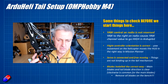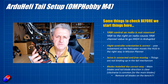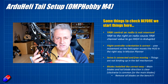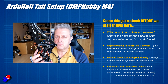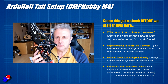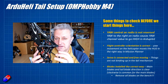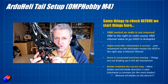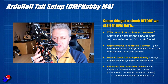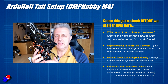Let's do a quick slide on prerequisites. First, make sure the yaw control on the radio and the radio calibration has been done. When you push the yaw control to the right, the value of the yaw channel should go to its maximum value in Mission Planner. Never reverse the rudder channel on your radio to try and fix a tail direction problem — the correction is done in ArduPilot.